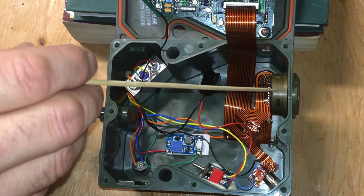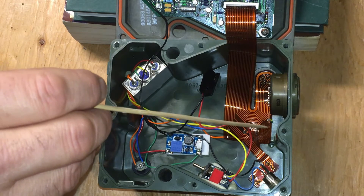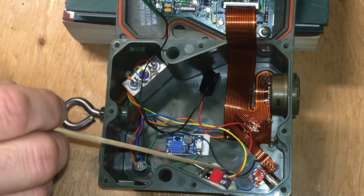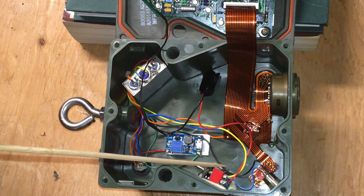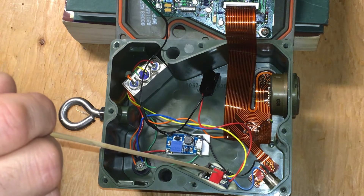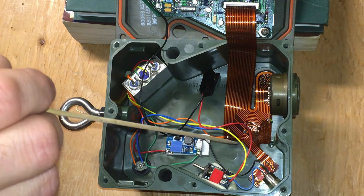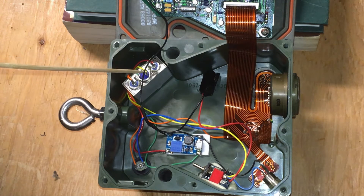The yellow wire is one of the three wires I cut off of J1 — you can see where I'm pointing right here. I cut them free from J1 and connected the yellow wire, which was pin B on J1, to the double-pole double-throw switch. So positive voltage comes in, you flip the switch, and it goes out down the yellow wire into the original switch.